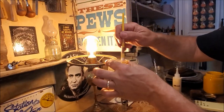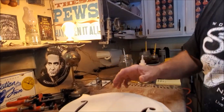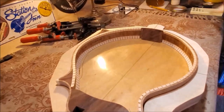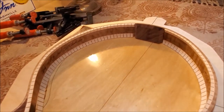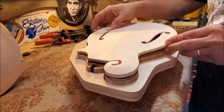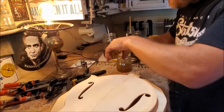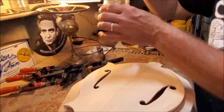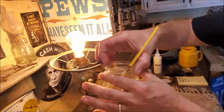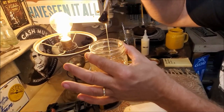This is a pre-application that I like to do. It's thinner — a little bit thinner. What I like to do is add this to, in this case, the rims. Add a thin coat to the rims and a thin coat of the pre-application to the glue surface on the top. Let that dry. Then I make sure all my center lines and everything is in place. And then this is my final application. If you zoom in on this, it's a beautiful color and you can see how much thicker it is. This thickness means the setup time is quicker.